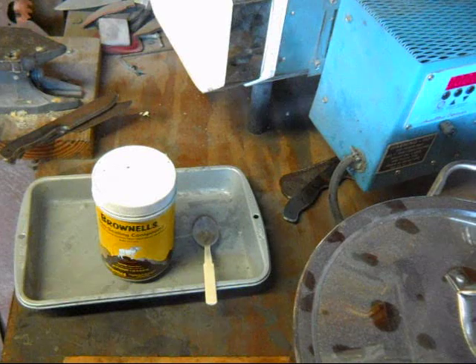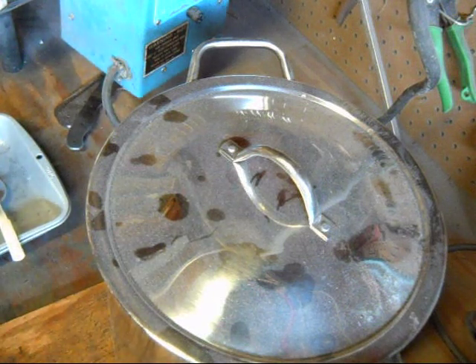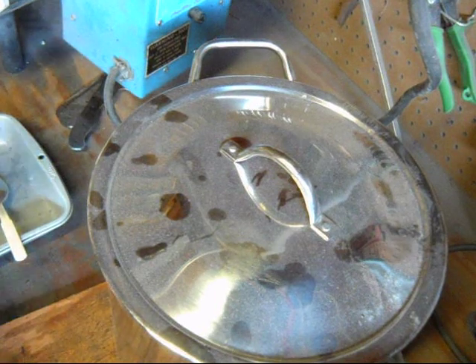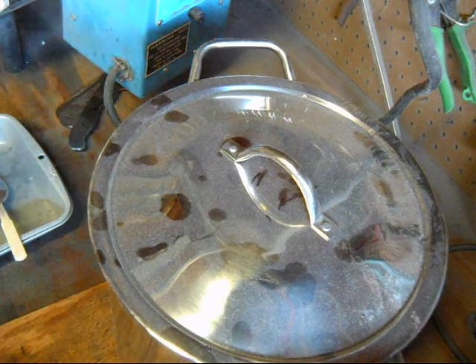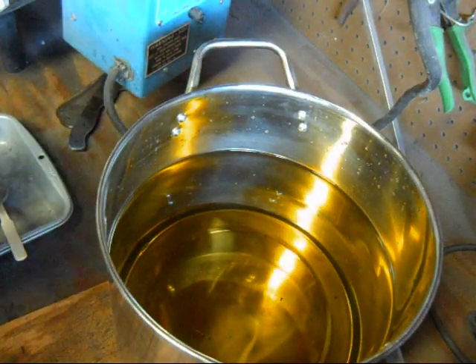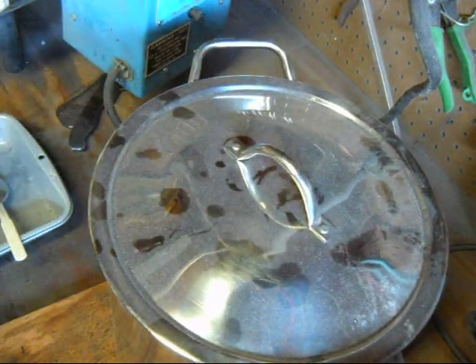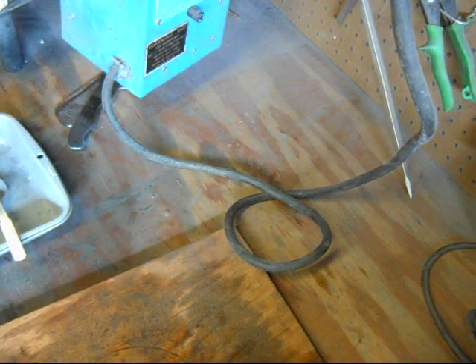Something else I'm doing — if you noticed in the last video I did on heat treating, I was using motor oil in just a coffee can. The problem with that is I can only do two blades, and I heat treat four at a time. So I always had two coffee cans sitting there, because once you heat two, the oil temperature rises enough where you're not going to get a proper heat treatment on blades three and four — it just won't quench fast enough. So I've moved to a larger pot, as you can see, and I'm using canola oil. It cuts down on the smoke and the smell, and I've got two and a half gallons of oil in the pot right now, so I can handle four blades easily without changing the properties of the heat treatment.